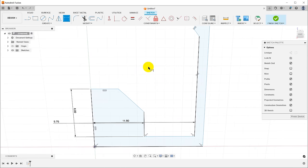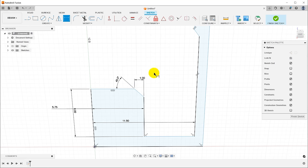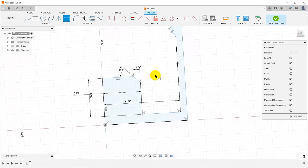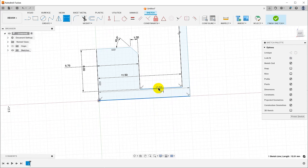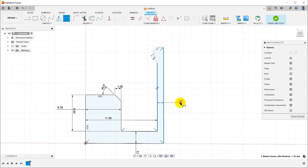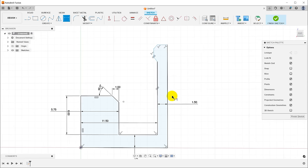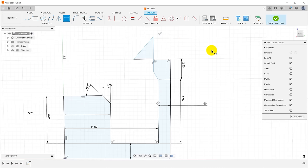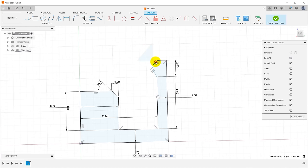The overall chamfer I want at 45 degrees, so I'll put an angle constraint of 45. The width of the chamfer I want to be about one millimeter. The thickness of the base, let's call that two millimeters. The thickness of the outside wall, let's make that a millimeter and a half. The overall depth up to this lip, from my measurements, I want that to be 8 millimeters, and then the rest of the height another two and a half.